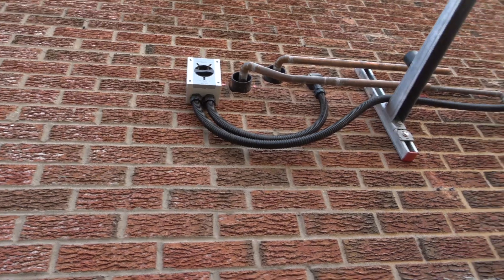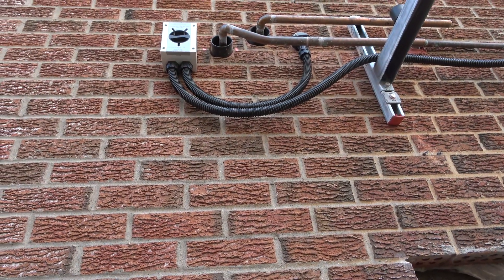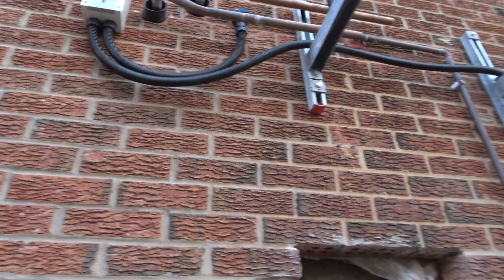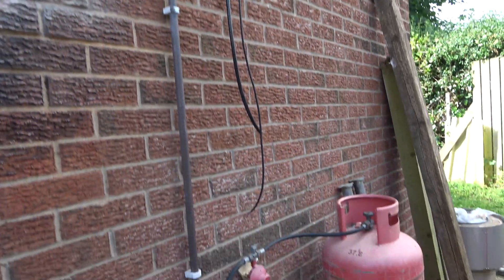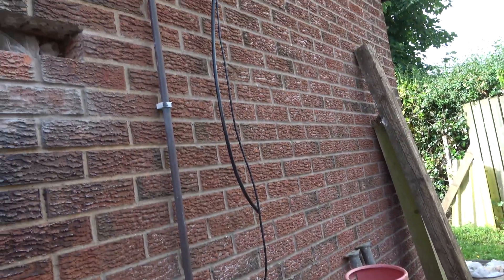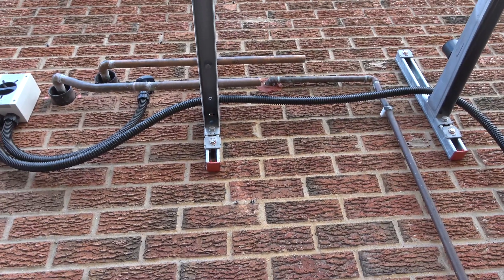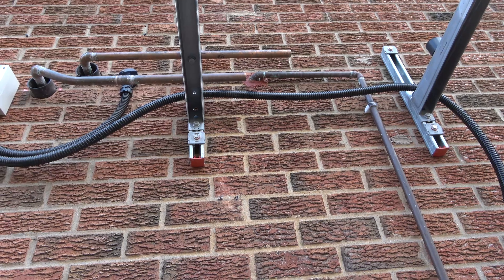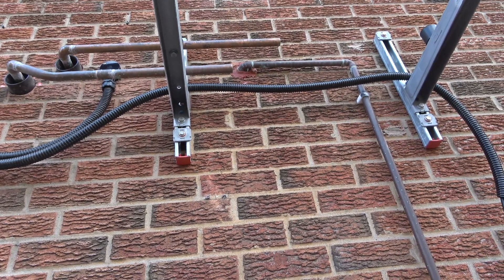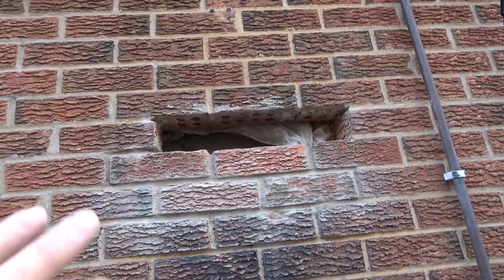There's the isolator and the feed from the house. It also has the 24 volt bus output, and they all go through the isolator and down to there, just waiting to be wired in. We also have the flow and return pipes — they're just waiting to be connected up. And we've got a bit of brickwork to do there as well.